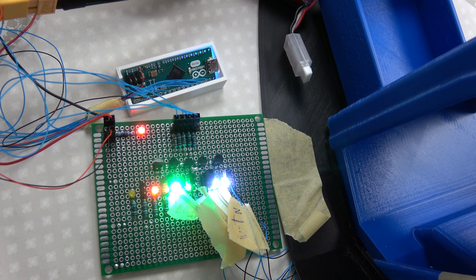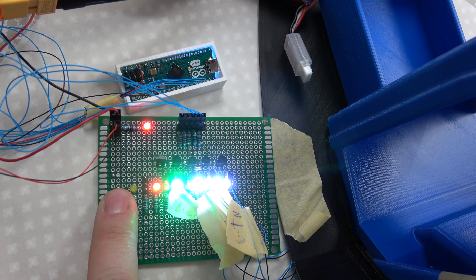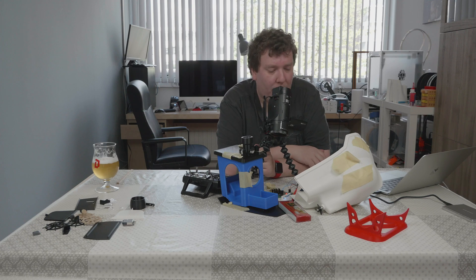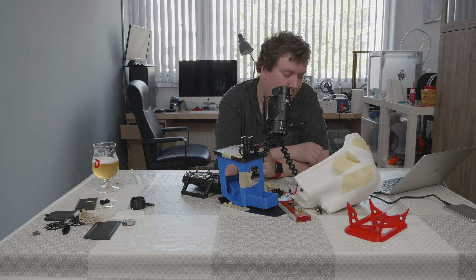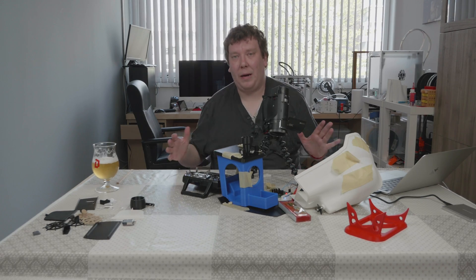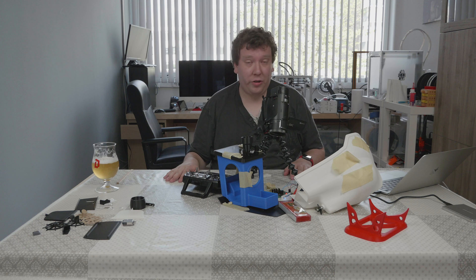If I flip the next switch, you'll see a white LED come on — that's the inside cabin light. I also have a yellow-orange light controlled with another switch. The motor itself is a really common brushless motor, nothing special. The speed controller is a Hobby King 10-amp speed controller, which should be more than enough to power this motor. It's just a bit more than the general electronics suggested by Thulin, because I wanted that dynamic lighting — and it adds some value to the boat.